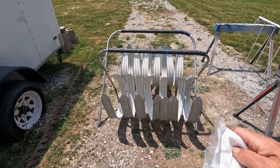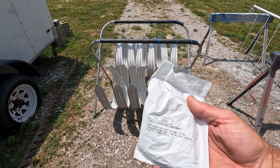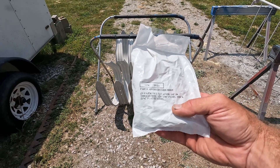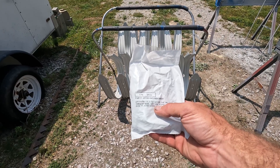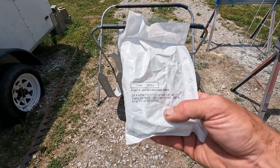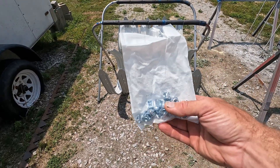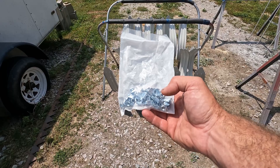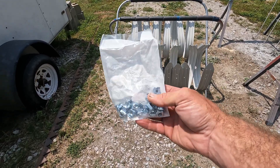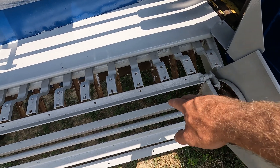I picked up a couple of the nuts that hold these onto the baler — they're called panel nuts. These are for quarter-20 bolts, for panel thickness of 0.125 through 0.156. A couple were missing and the previous owners had put regular nuts in there, which makes it really tough to get in there with a wrench and hold the back side. These are called panel nuts and I found them at McMaster-Carr.